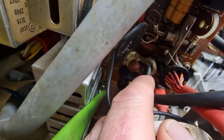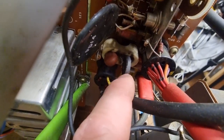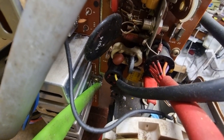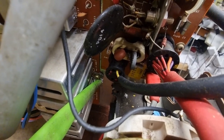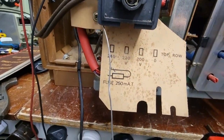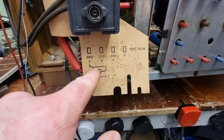when we made a video. Look at that. Now I just haven't got one of these to hand. I'm sure I have one in stock somewhere, but I haven't got one to hand. So what I'm gonna do is bang in a 15 ohm resistor. I know, naughty, but it will allow us to continue on until I can get my hand on the proper part. Also, of course, essential to check is the mains tapping.